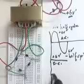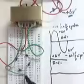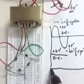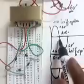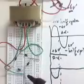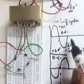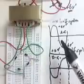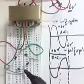As per the working principle of the transformer, as far as the second tap is concerned: when the right hand tap is in the positive half cycle, the second tap will be in the negative half cycle. And when the right hand side tap is in the negative half cycle, the left hand side tap will be in the positive half cycle. So when the upper portion of the bridge is not conducting for the negative half cycle of the upper tap, at the same time the lower portion of the bridge will be conducting for the positive half cycle of the left hand side tap.